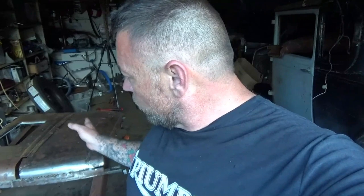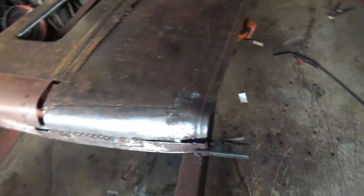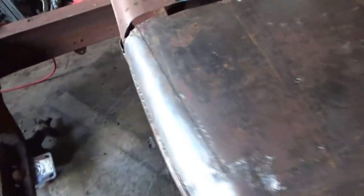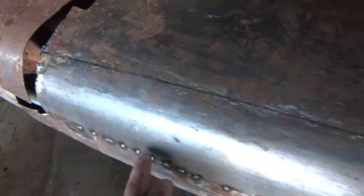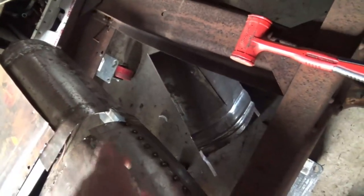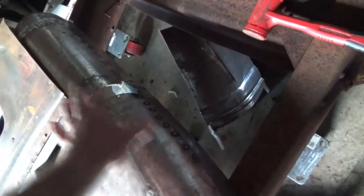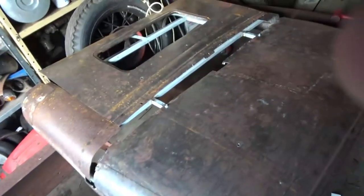The bottom section's tacked in, fits okay. Let's have a look at the rest of it and we'll go from there and see what we can work out. So basically, we had all that extra metal and all I did was centre it. Screwed in where it needed to be at the top, and then I sliced it on the bottoms and then butt welded it or tacked it along that edge, same on the other side. I'm trying to keep the radius somewhat in order — it's different, but the swages which I need to weld in will probably fix that issue. I can manipulate that, so there's no major stress. It stresses me, but I can see through it now, so we'll be right.